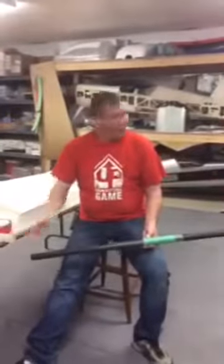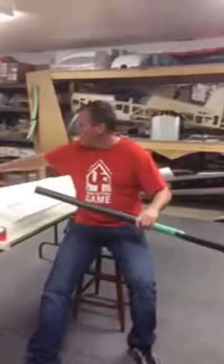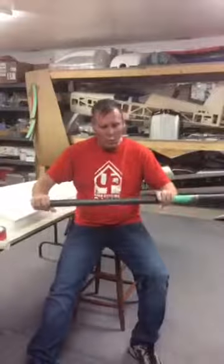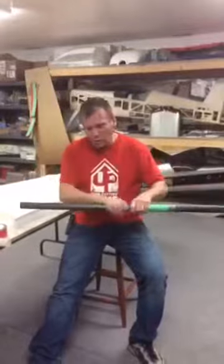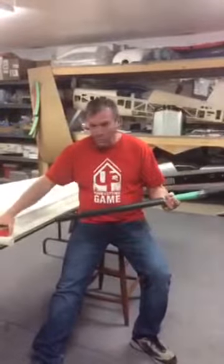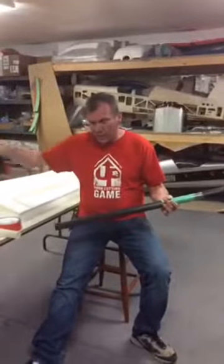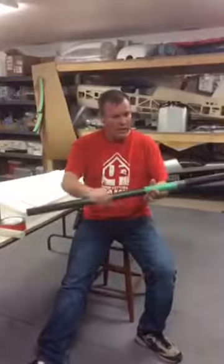So then you're going to use the sheet of Mylar that we talked about, or glass, or, you know, thick plastic. You're going to clamp it down to your bench so that when you're rolling, you can roll and pull so that it gets rid of the air bubbles. So, wax, PVA, 1 1/4 wraps of wax paper, only taped to each end.